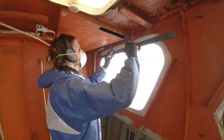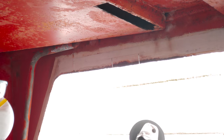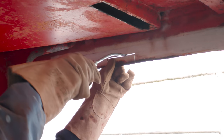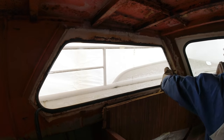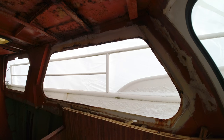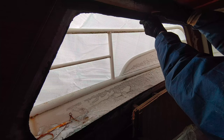Next I measure and cut out the rusty areas to weld in new steel plates later on. I repeat this process for all the windows that need treatment. Just look at how badly this one was affected. And here again, a first little round of grinding to reveal all the rusty areas, and then I measure and trace the lines for cutting.